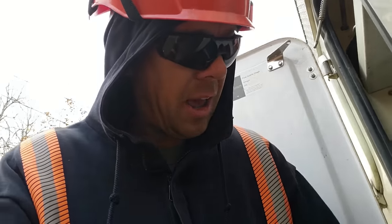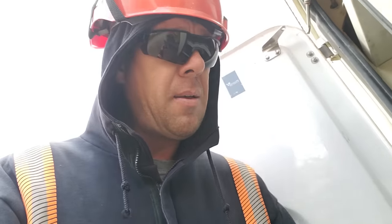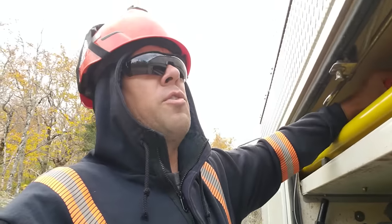On the distribution side, this is our job site right here where the wires are down. I can't take out a permit, put grounds on, and then leave. So what we're going to do — we're still going to ground the lines, it doesn't have to be dismantled today. Instead of an actual work permit, we're going to have a conditions abnormal tag, which is similar to a permit. The switch location is going to be tagged both in the system and in the field, but under the authority of our dispatch — the DSO, the distribution system operator. When a crew comes by next week, they'll simply contact the DSO, indicate the number on the tag, and dispatch will surrender the ground on the line under their authority to whoever is going to take the permit, so they are able to both work on the line and remove that ground once they're done.